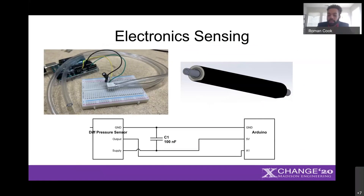Next I'll discuss the pitot tube, seen in the top left. It has two tubes: one stays with the sensor in the nacelle and measures the static pressure, while the other is fed through the hollow shaft to the tip of the wind turbine to read the incoming dynamic pressure, as shown in the top right image. Using these two pressure values in Bernoulli's equation, we calculate the incoming wind speed. At the bottom you can see the electrical connections for this sensor.